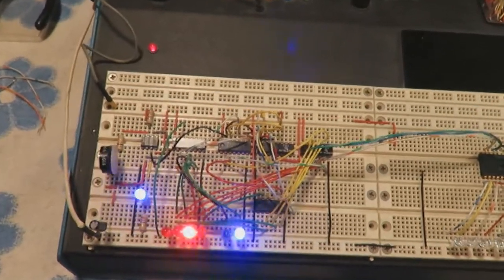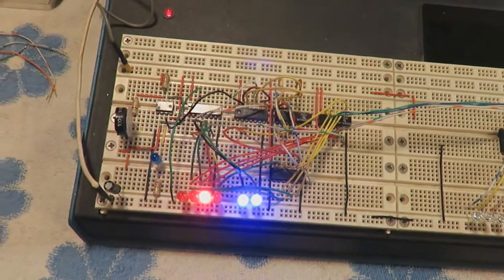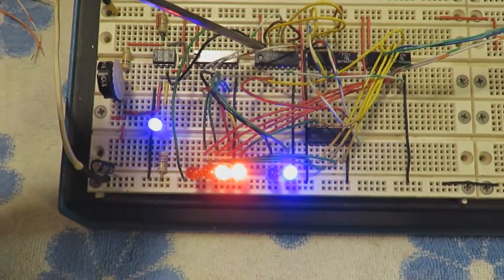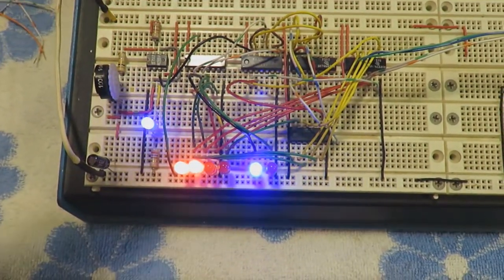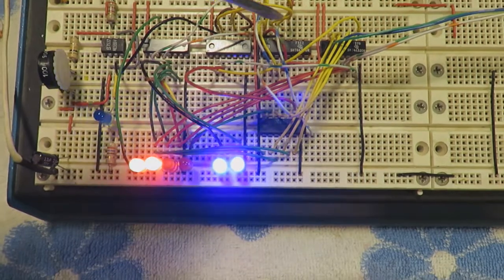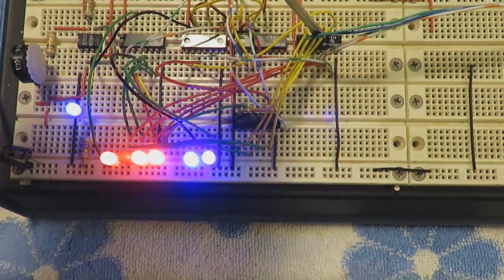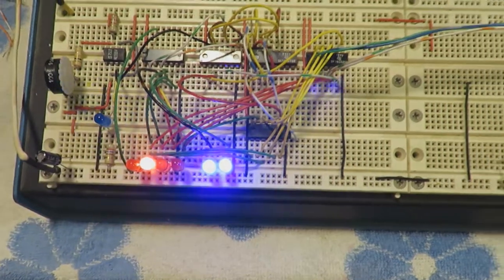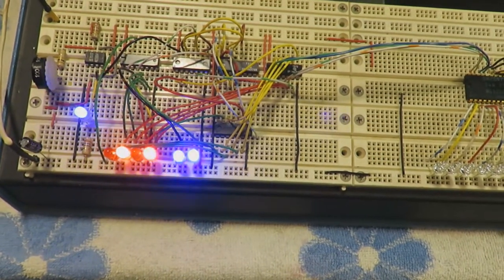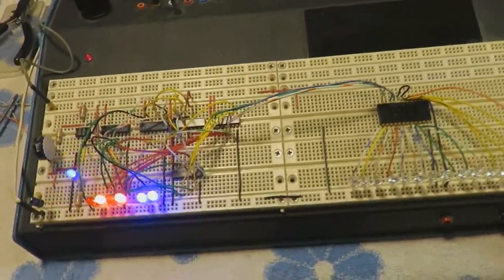And I was able to do this with, well, I got a 555 timer for my clock here. That's the 193 there. Then I had to use a few NAND gates, 7400. And I used a flip-flop, 74LS76, and just a 74LS20, I guess, right? And a hex inverter, 7404, I think.